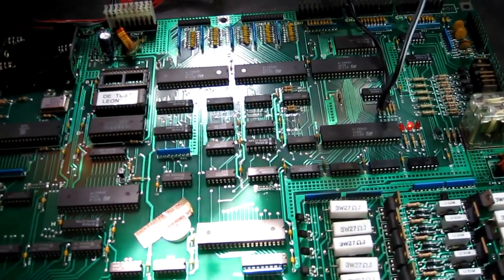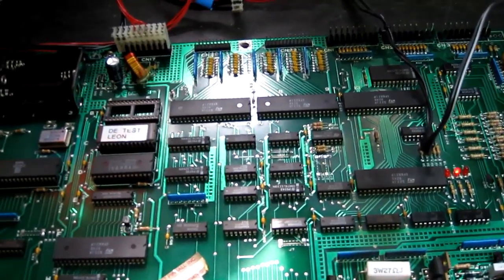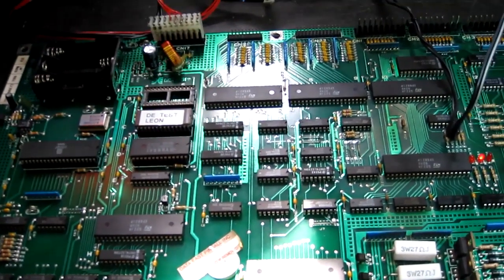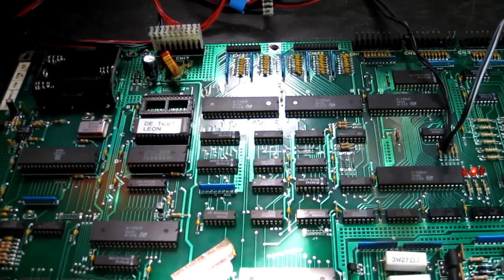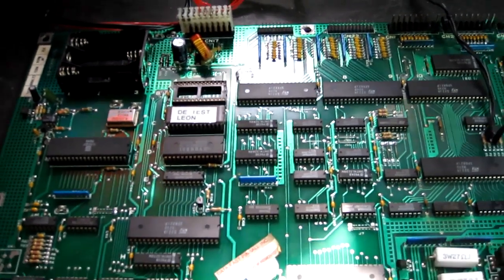It's on the test bench, and a quick check with the test ROM shows nothing happening at all. Normally when we see this sort of thing, my quick guess would be that one of the PIAs has got a short on the DataBus side. That tends to basically stop the entire system from running — I've seen this a few times — but it could be something else. We'll have to go through and check everything systematically until we find the problem.